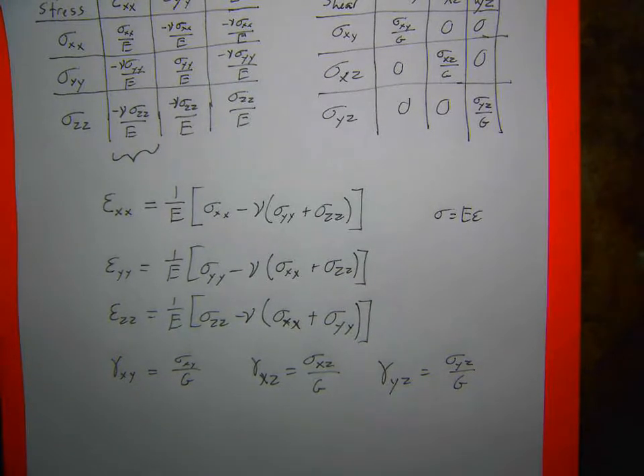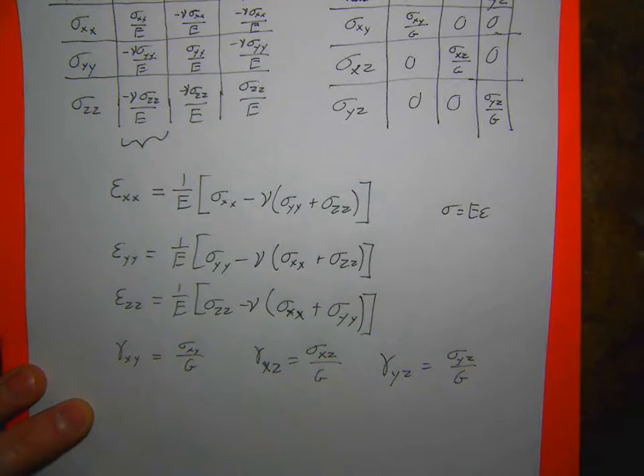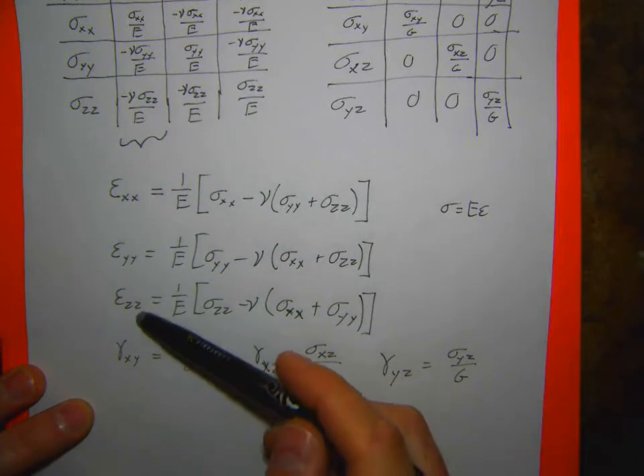Question: is the transverse strain due to material inconsistencies? Not exactly. In a beam bending lab, you don't have a stress transverse to the beam but you still get a strain there. The body changes shape in reaction to the force. We're assuming the simplest case — homogeneous and isotropic. The reason it contracts is essentially volume conservation: if I stretch it out in one direction, it has to thin out in the other two. So even though I'm not applying a load transverse to the beam, I still get a reaction strain transverse to the beam.